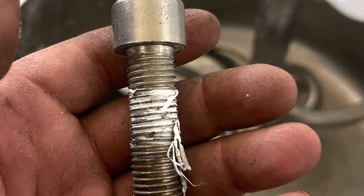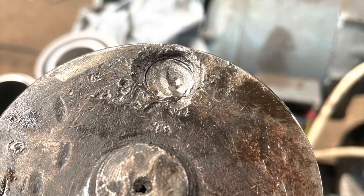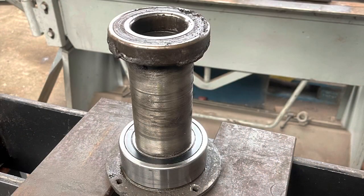This is one of the other bolts that had PTFE tape wrapped around it. The customer had done this because the bolts were falling out. Here's a quick look at the shaft removed from the machine. You can see the face of the shaft has quite a lot of damage and you can see the sheared bolt in the back there. These are stainless bolts in a mild steel shaft, but the shafts are chrome plated for corrosion resistance. These faces should be very flat to transmit the torque from the tool correctly.